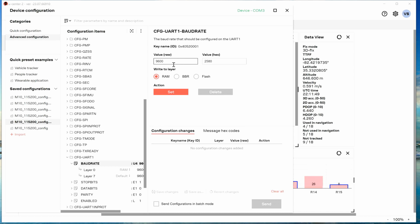I figured out that there's RAM in this module. There's battery backed up RAM in this module. But there's really no flash RAM in this module. So any configuration changes you make are going to have to be saved in this battery backed up RAM. So when this powers up, it reads the ROM on board and gets its default setup. Those default setups can be modified by the module itself on power up from the battery backed up RAM information.